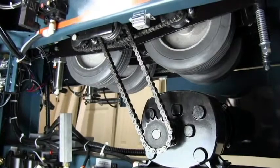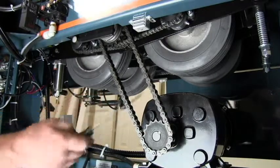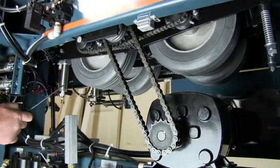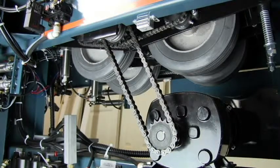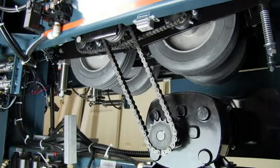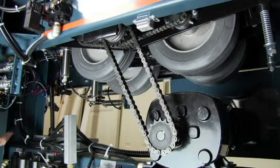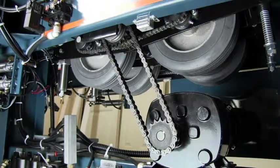The 450 has four power feed wheels, two on each side. The power feed wheel closest to the outfeed end is always up and is spring loaded. The front power feed wheel is raised and lowered with a cylinder — when the cycle starts it goes up, and when the cycle ends it comes back down. The speed at which the wheel goes up controls the spacing between the first and second nail, and that speed is controlled by a flow control. The slower the wheel goes up, the closer the first nail is to the second; the faster it goes up, the further apart they are.